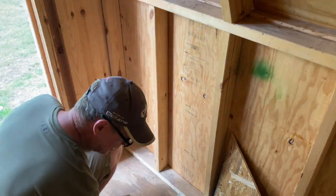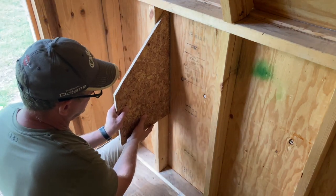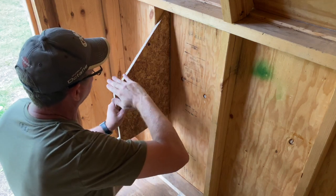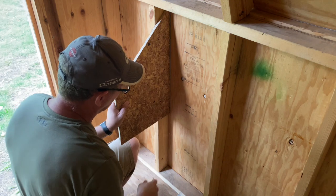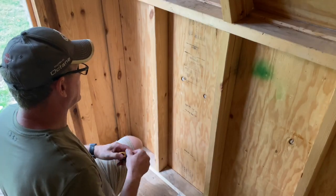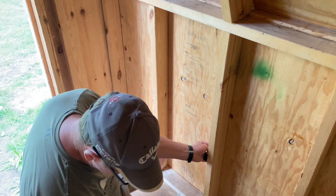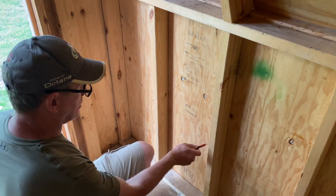So here's what I've got going on inside. I want to cut a large enough area so that the chicken can get in to the nesting box. I'm thinking about right in here because I want to leave just a little bit of room for the piece of plywood that's going to hinge open, and also for the hinge itself. So I'm basically just measuring this right now — that's about 24 and a quarter inches. I'm going to do the same thing over here on this side to make sure we get the right spacing and that this is going to be nice and straight across.